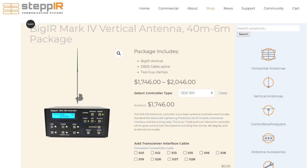This is all thinking entirely in terms of those antennas that require radials. If your antenna doesn't require radials, then you don't have to worry about any of this. My antenna is a StepIR BigIR, and it does need radials. I've got about 32 radials of various lengths out there, and the antenna works great. It's not working right now — I've got to troubleshoot it — but there's a foot of snow in the backyard and I've got a broken ankle, so that's going to wait for spring, which is hopefully coming up soon.